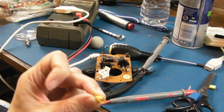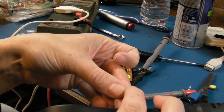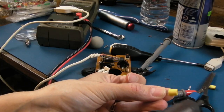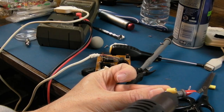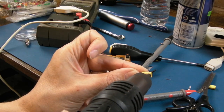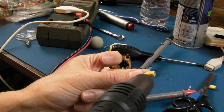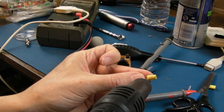And this is the thing, I see people on these forums, you know, help, I need to get a photo component, a photo diode for this mouse, and they're no longer available, and oh, what am I going to do? And it's like, well, just use another LED. A little bit of hackery and bodgery. You'll be amazed at what you can achieve. And these are always going to be in stock. There's so many people selling these infrared LEDs.